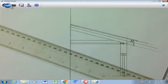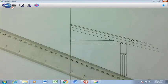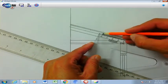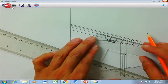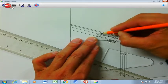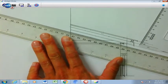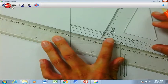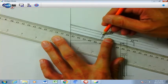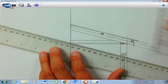I know the distance away is 53 center to center. So now, wherever the crossing is, I'm going to measure 53 away — that's my center. Since 3 is the size of my purlin's width, I'm going to go a millimeter and a half each side to give me the 3. Then I'm going to do the line in between the sheeting and the rafter, and the line in between the sheeting and the rafter, and just cross it over as my hatching. That's all you need to do.